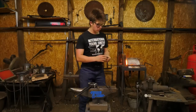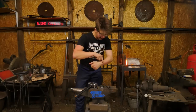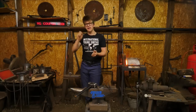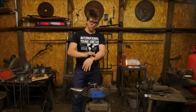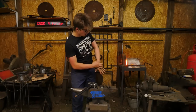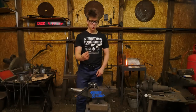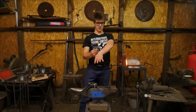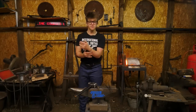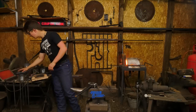Nath, thank you so much. Working with iron, I really appreciate your question. As far as I recall, the way you measure your bangle is you take a piece of paper, lay it all the way around your wrist where you plan to have it, and take that measurement. Then grip your fingers together so that they're touching that bone, take a measurement of that width, and subtract that from the overall circumference of your wrist, so that the circumference allows for us to slip it through and pop onto the wrist. Then it's just a simple case of twisting it and pulling it off. So it's circumference minus the thickness where you intend to slide it on. Thank you so much for the comment, Nate.